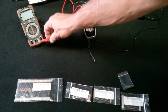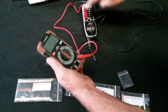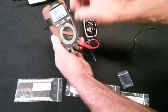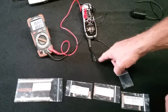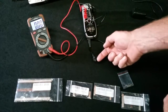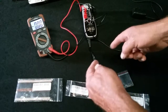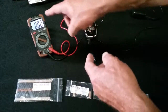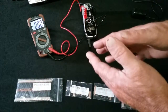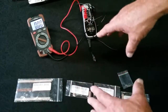That's what I use — it's a homemade gauss meter you can build off the K&J Magnetics site. They work pretty good. You just plug them into your voltmeter, red to positive, black to negative, and put it on 20 volts. As you bring a magnet close to or far away from the hall sensor, you'll get a reading — one side shows positive, the other negative, depending on which side you're on and which way you turn the magnet.